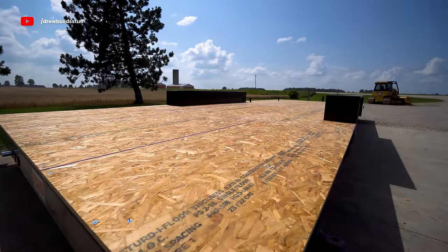So we're first installing the drip edge along all the lower edges of the roof. And this is why I left some of the white plastic on the bottom of this roof underlay, so that I could lift it up out of the way to screw in the drip edge. And then we can pull that white plastic off and then stick this underlay right down on top of the drip edge. And then we installed this gable edge trim and cut a nice miter where they met. And by we, I mean Joel did everything.